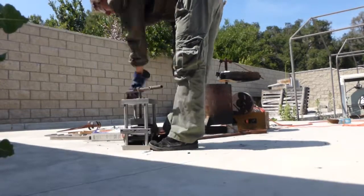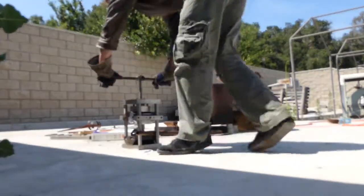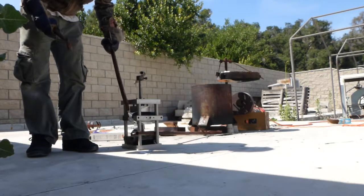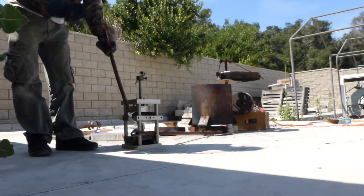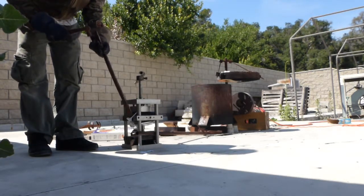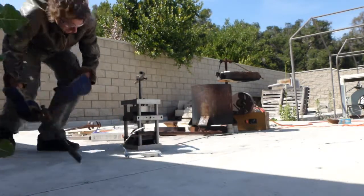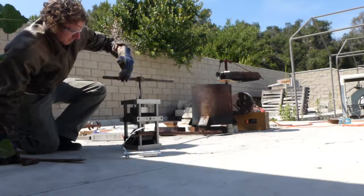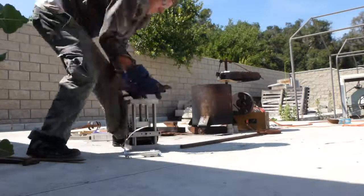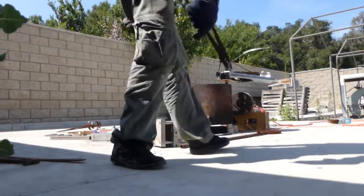After some time for cooling, breaking open the mold and seeing what we got. I noticed one thing this time: I grossly overestimated the amount of time I needed to let this thing cool off before opening the mold. Another advantage is that since it isn't all the way cool, it hasn't had enough time to shrink around the protruding half of the cavity, thereby making it easier to eject. But this time we didn't even fill the mold completely. At least I was able to get the part out, so back into the crucible it goes.